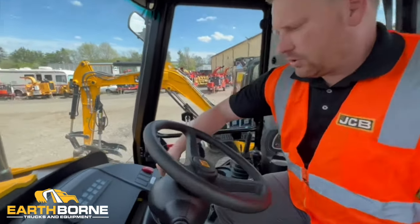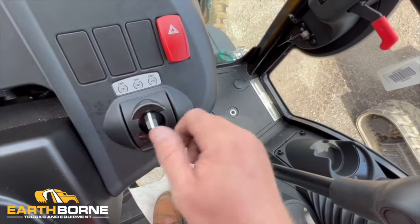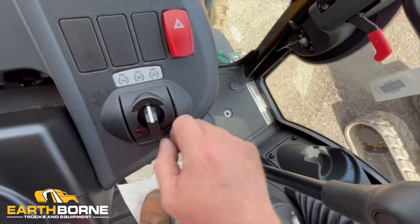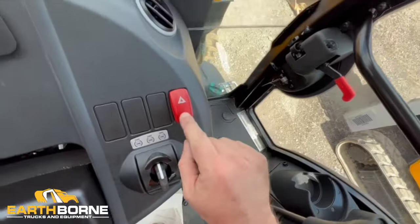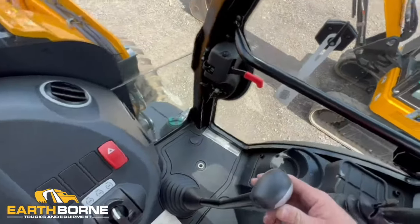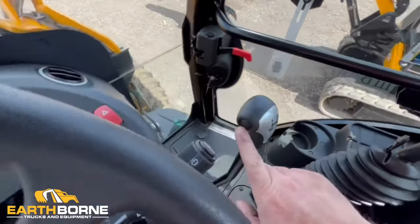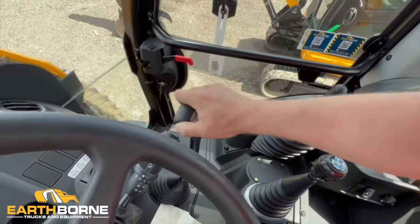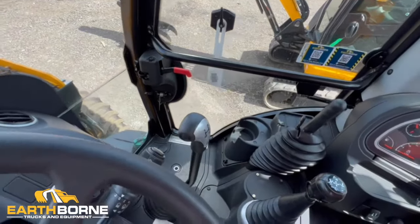Moving around to some of these controls, you have a couple of selectors. This one would be two-wheel drive and two-wheel braking. The center one it's on now is two-wheel drive and four-wheel braking, which is best for highway use. And then you have a four-wheel drive, four-wheel braking selector on the right-hand side. Moving up here you have your blinkers and your four-ways, which will set off the lights on the outside of the machine. Moving down here you have your gear selector — you have four gears in this machine. On the side of this selector is a transmission dump button. If you're moving on the fly from gear one to two, you're gonna want to hit that transmission dump button before moving into the next gear — sort of like a clutch in a car.